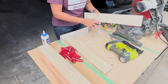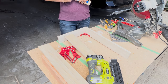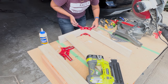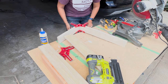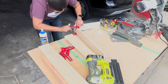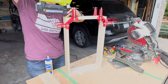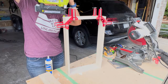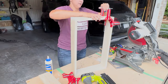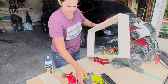Next it was time to assemble. I used wood glue, my corner clamps, and my brad nailer. I will be using my pin nailer on part of this as well, so I would recommend having both a pin nailer and a brad nailer. If you do not have either, that's okay — wood glue would have done just fine knowing that this will never be moving inside that little cabinet nook. After I got my corner clamps all nice and secure, I added some brad nails in each of the corners on the outside, since that part would not be shown — it will be inside the cabinet where you'll never see it.